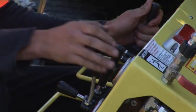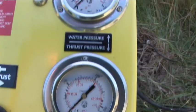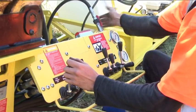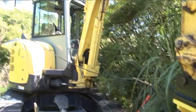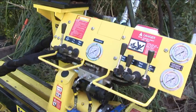The regulatory valve allows different functions such as rotation and thrust to be used at the same time. The EZ Drill has been designed to operate on machines with a fluid flow of up to 60 litres per minute and pressure up to 40 bar.